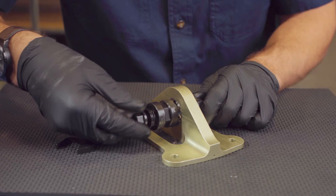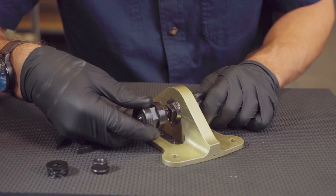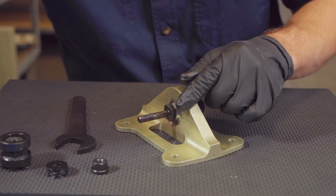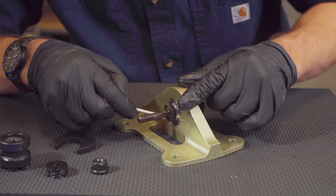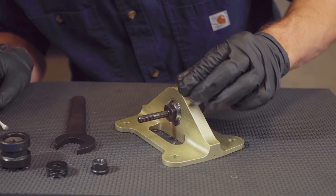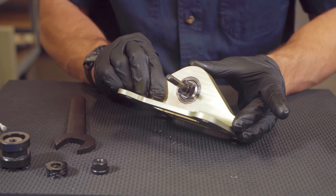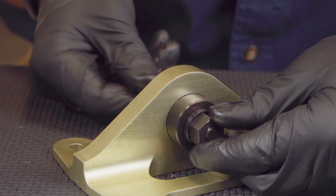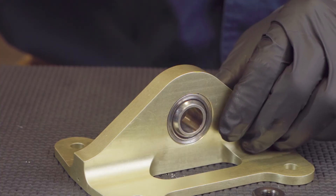Disassemble the cutting end of the portable cutting tool — remove the flange nut, spring, thrust bearing washer stack up, and cutter — and clean the face of the bearing. Loosen the anvil support side flange nut and guide rod and remove the entire cutting tool assembly. Lastly, use the SMT removal tool to extract the cut bearing.